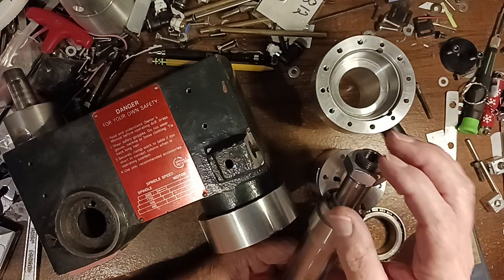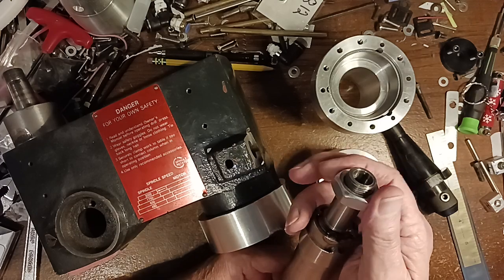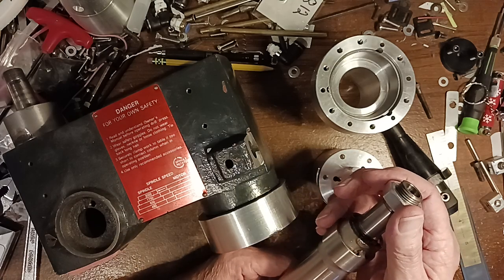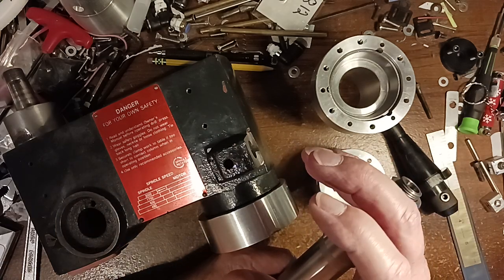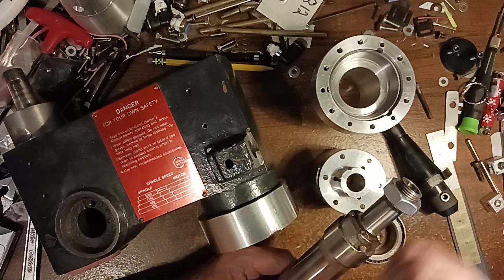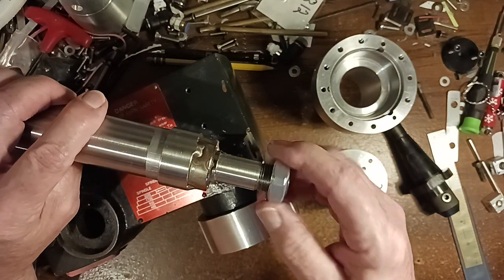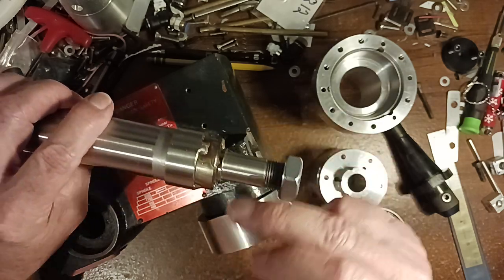But when I bought this, it was a long time ago, maybe 10 years ago. I thought, well, the piston one would work because I didn't know any better, and it was cheaper. And that's why it's cheaper, because the tool holder will move if it's under a lot of pressure, and it doesn't really repeat. When you put it on and take it off, it won't repeat. But it was just for hobby purposes. Anyway, I was able to generate that thread, and I was really surprised, and it worked out. So I'm going to put a pulley here.